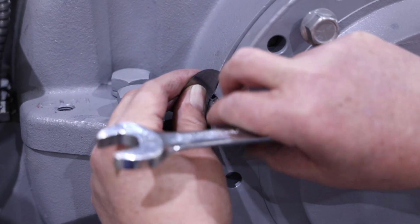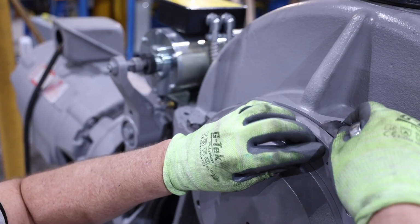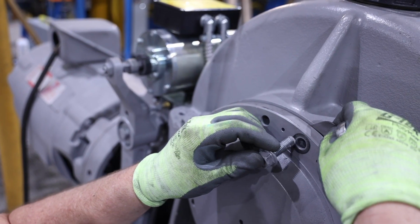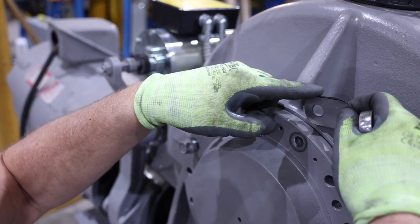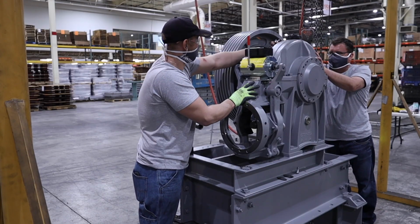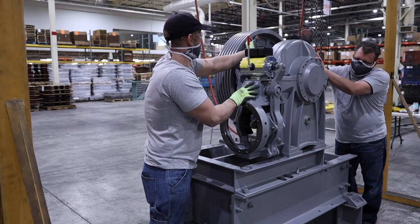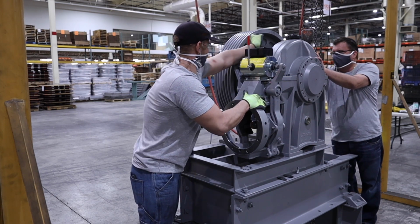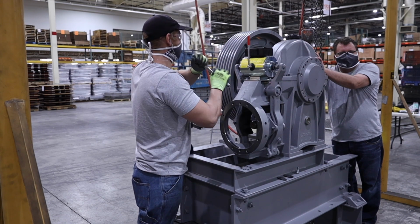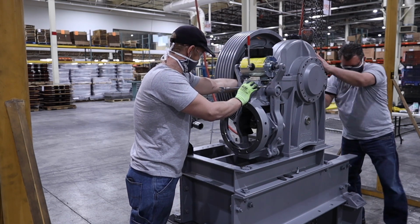With the eccentric slightly moved away from the housing, rotate the shims out on the upper bolts that secure the outside eccentric to the upper housing so they can be seen. While holding the shims, remove the 2 upper bolts on the outside eccentric. Note the number of shims under each bolt as they are removed. Also, remove the 2 upper inside housing eccentric bolts. Note there are not any shims under the inside eccentric bolts.